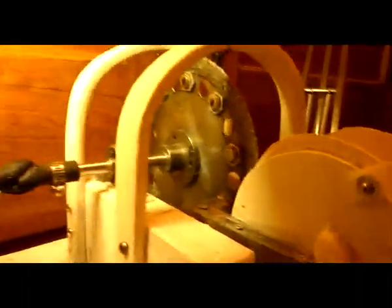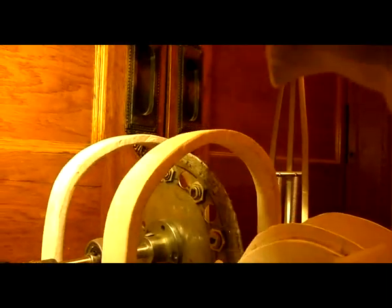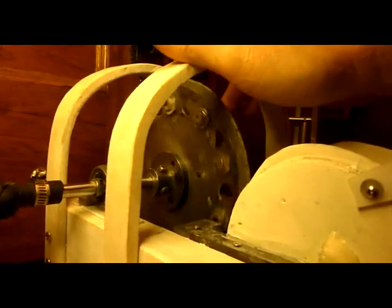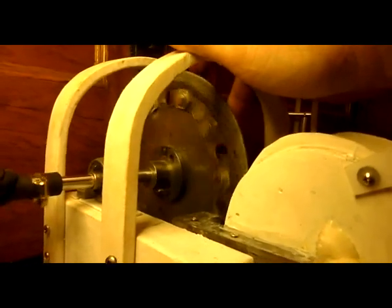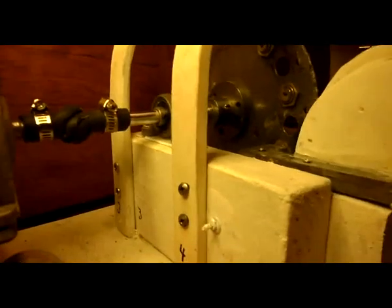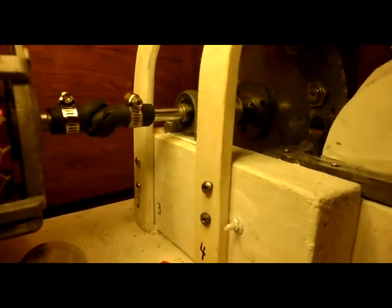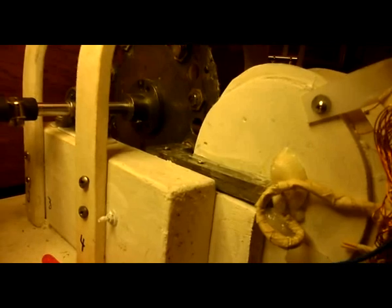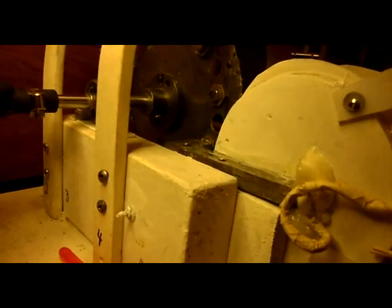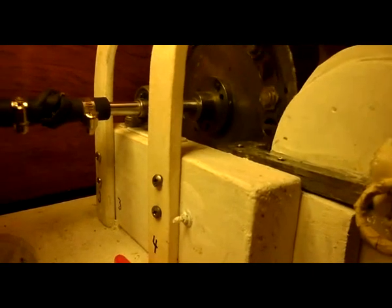Let me show it to you again. See the really tiny little saw blade? And it's hard. You'll see that lock in there? See how those small magnets, even those small magnets, lock hard. And they drag down the motor when it's running. So it doubles when, well, I should say that this is 1/4 of an amp at the 20-25 volt range that I'm operating. And then when I hook the coil up, it doubles. So I'm at 0.5 amps or 0.45 depending on how fast I'm running. But there's definitely a doubling relationship in amp draw because of that cogging.